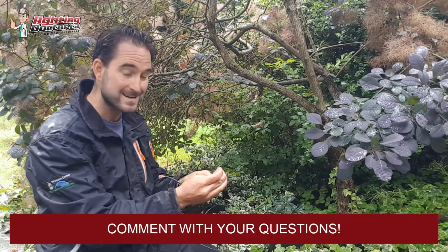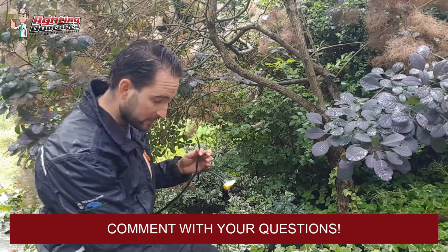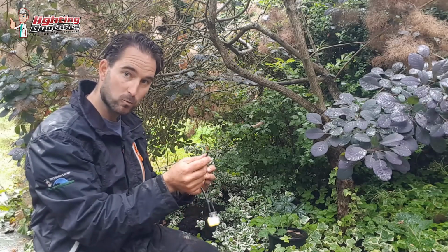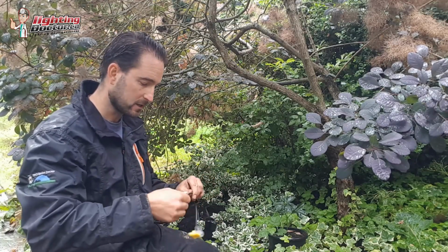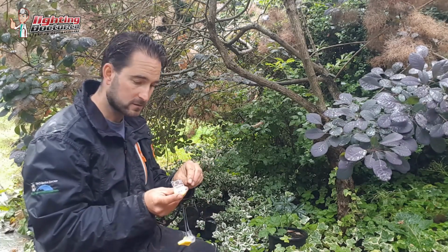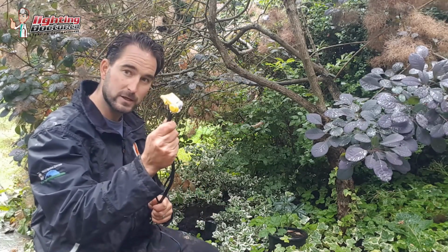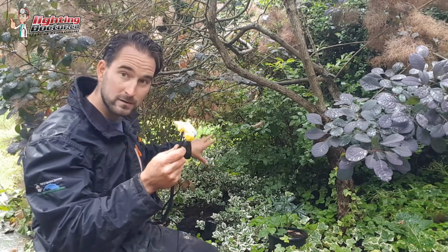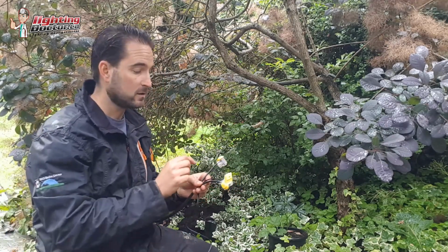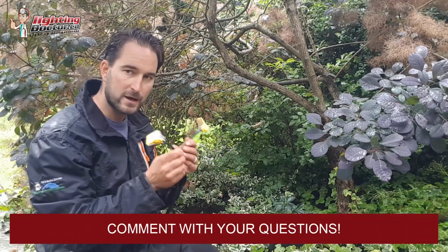So on the last fixture, you're going to have 1 extra hole for wire. You don't need to use that. You've only got 2 wires coming in. And then you need to do that one more time because you still have another wire from your fixture, and you still have another 12-2 wire coming in. So same thing. You're going to throw that 12-2 wire in the big port, and that small wire from your fixture in the smaller port, and then still at that last light you have the 2 connections. The only difference with this and one in line is that in line, that extra hole is going to have the 12-2 wire that goes out to your next light on both of these, right? Because this is our last fixture, you have that hole empty.